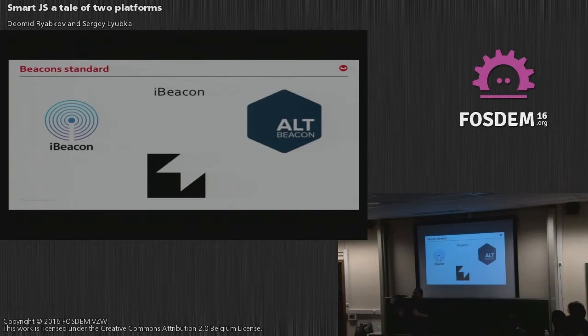So it's very much used for indoor stuff. GPS is something outdoors. You know how GPS works? Pretty much the same thing. It's broadcasting some stuff, it's localizing something, but it's outdoors. There is no range limit for satellites. Wi-Fi has a broader range limit. NFC has a very small range limit, probably 10 centimeters. RFID is probably about 100 centimeters, it's quite small too. The best, from a size perspective, way of emitting something is Bluetooth, and it's low energy, it's much less consuming than Wi-Fi.